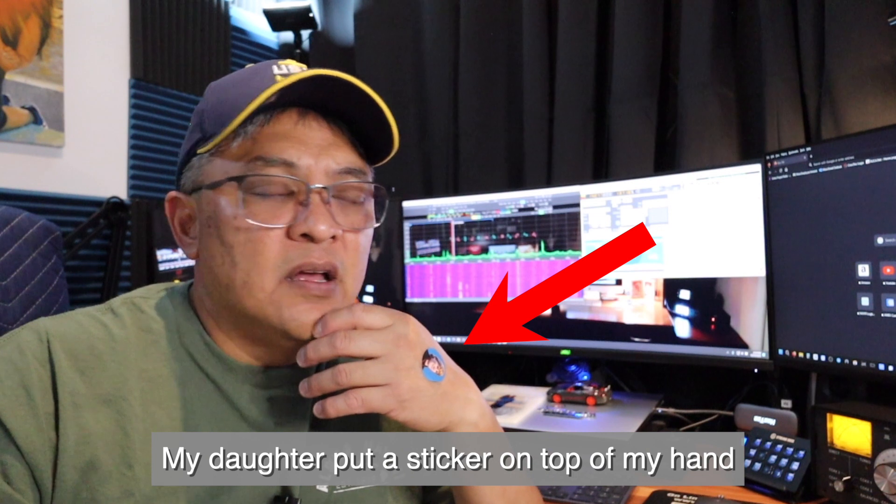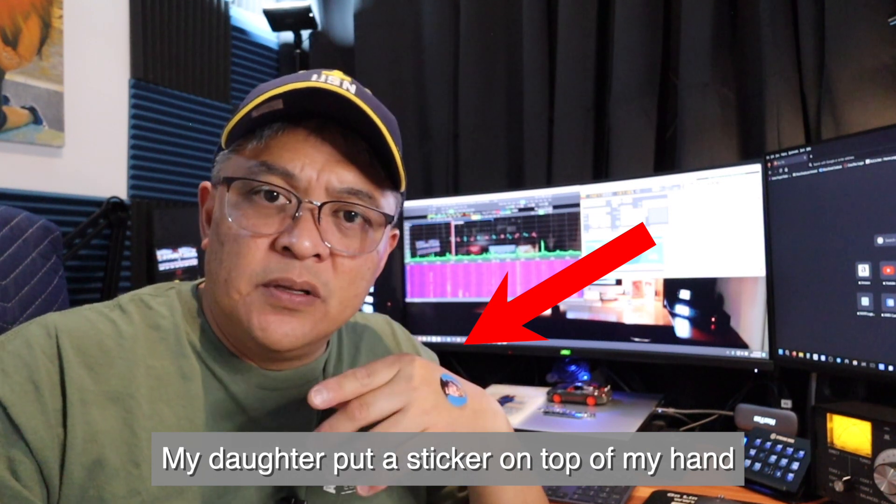I don't have that much space — that's a lot. So for 40 meters I centered the frequency to 7.2 and that came out to about 139 feet. If I subtracted the 80 meters and the 40 meters I come up short about 125 feet. I said scrap the 80 meters — my 80 meter inverted L is working fine. I'm going to build a 40 meter horizontal loop. Another name for that is a sky loop, so that's another terminology you may see on the internet. In this video I'm going to show you my setup and building process for this 40 meter sky loop.